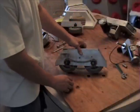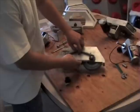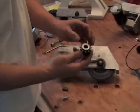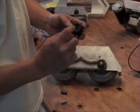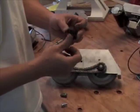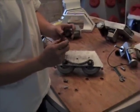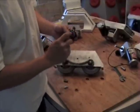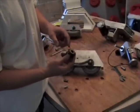The last time you saw this drive train, here's how you put it together. Obviously this is very slack right here, so we're going to put this idler gear in. All the idler gear is, is a regular gear, and inside here you see a bushing that was pressed onto this gear. This happens to be a three-quarter inch hole, and I reduced it down to a half inch hole, and that's a bearing right there, so this can spin.